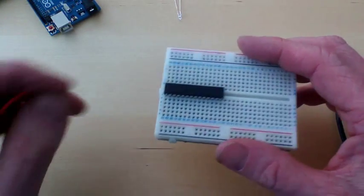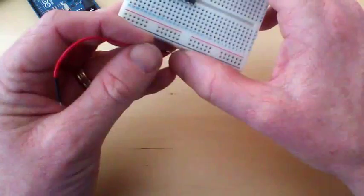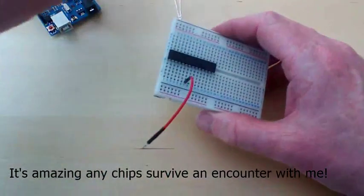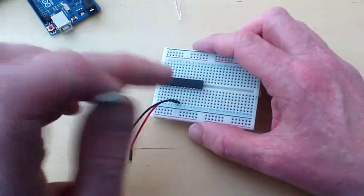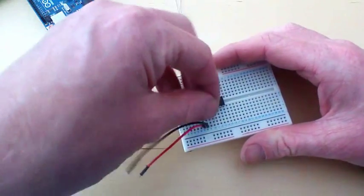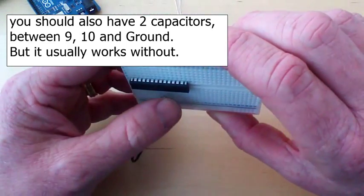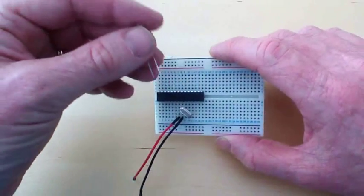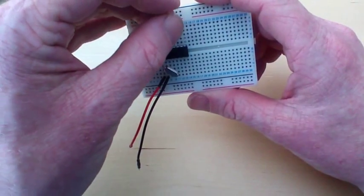Because we only need flashing the LED we don't need analog power, so we just need digital power. If you Google for a pinout you'll find that it needs five volts on pin number seven - put that in. Number seven is red, number eight is ground. We need a clock so you need a little crystal - you can program the chip to run without a clock but the crystal goes on pins nine and ten, so that's the next two along. It's easy to go in diagonally with that bond because the legs on the crystal are slightly further apart. On the other side of the chip we can plug in our LED again - long leg to pin number 13, which is actually pin 19 on the chip, so that's 15, 16, 17, 18, 19.